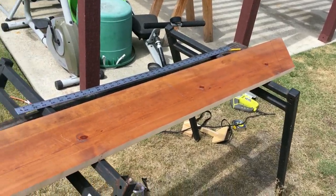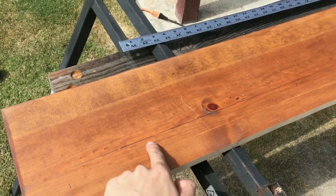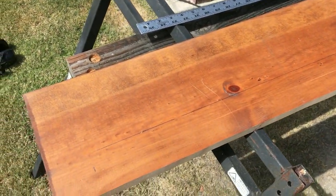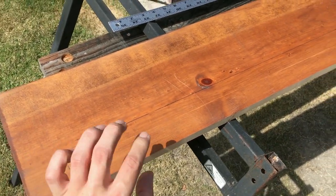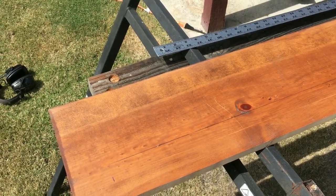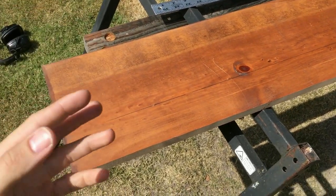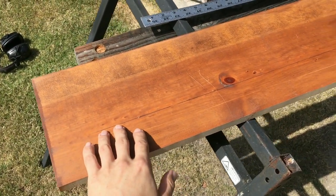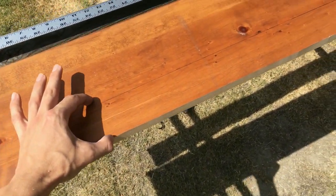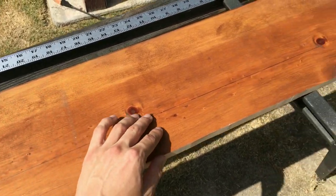Okay, we got the blade cut out, and this line here indicates where I'm going to bevel it, you know, for the cutting edge. I'm not actually gonna try to hone it down super fine, maybe, I don't know, 1/4 inch or so, just because I want this thing to have some stability. The wood is gonna be weak where it's really thin. We're gonna keep it as thick as possible. So there's about 2.5 inches in. I think that'll give us a good fat visible line where the cutting edge dips down.